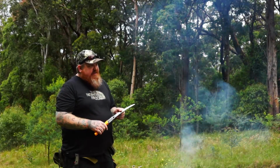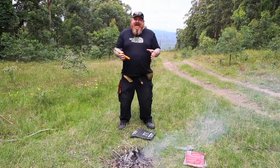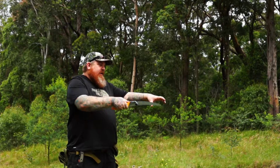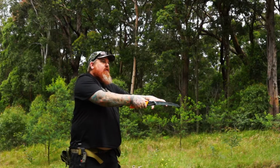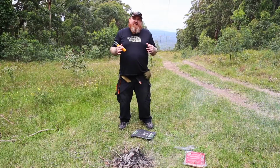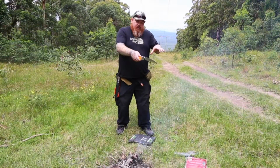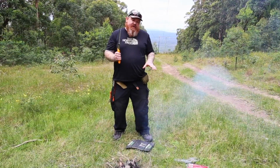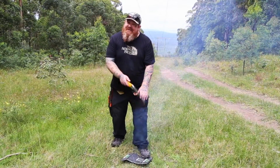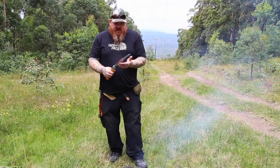Now this has the curved blade too. What's the use of a curved blade? When you are sawing, not everyone does this, but your natural human movement moves up and down. It's actually very unnatural to pull straight back and forth. As I say, everyone is different, and some people will cut like that, but with your general human movement and the way your ligaments move, you will move up and down. So that's where this curve comes in. It also makes it a little bit easier to get through the wood when you're sawing down low, and then again at height. So that's what that curve is for.